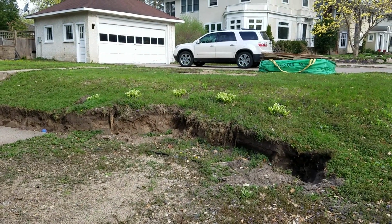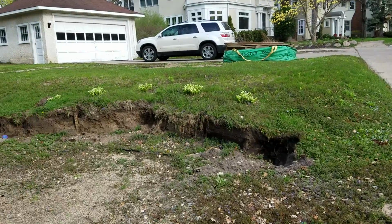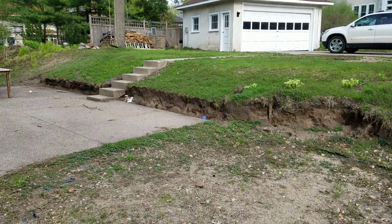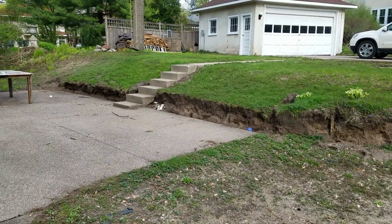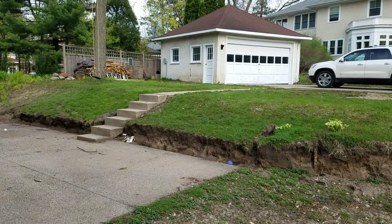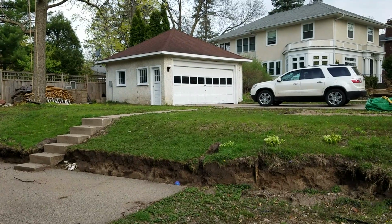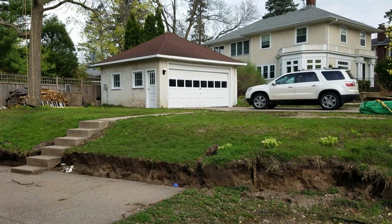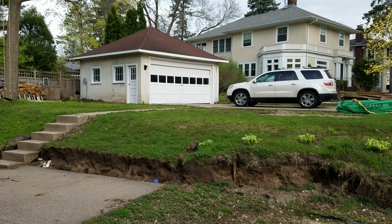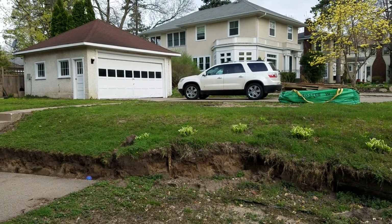Customer is looking to get an estimate to install some tiered retaining walls in their backyard. So you see where they had this old retaining wall right here. We're actually going to build a tiered retaining wall that goes up to the height of that top step now. So we've got about 40 inches of drop. So we're going to go with two 20-inch walls, and they will be Rhodes Chilton and weathered edge Chilton.